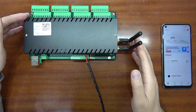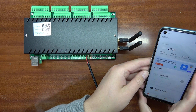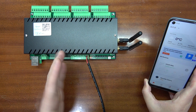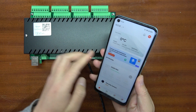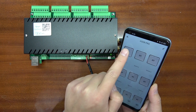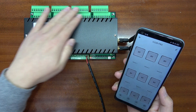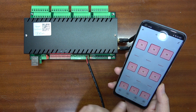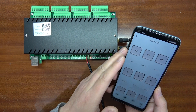Hello everyone. In this video I will show you how to use the H32P Pro relay controlled by the TUYA application, and how to use the input channel with your sensor so that it can trigger automation by the TUYA mobile phone application. You can very easily control this relay and turn it on and off using your mobile phone remotely over the internet.